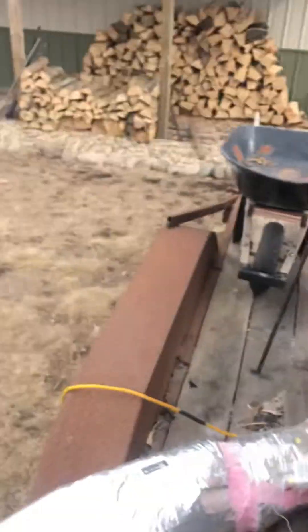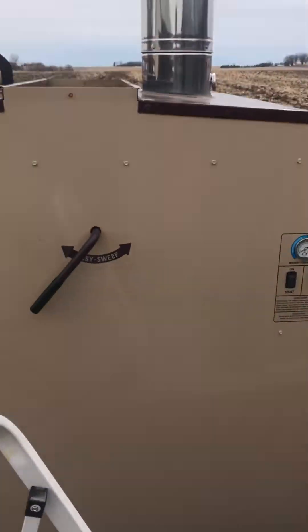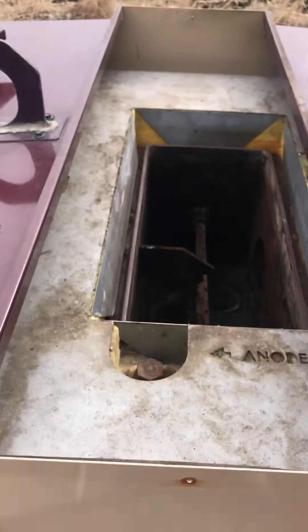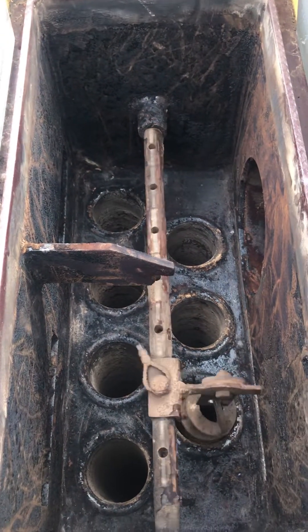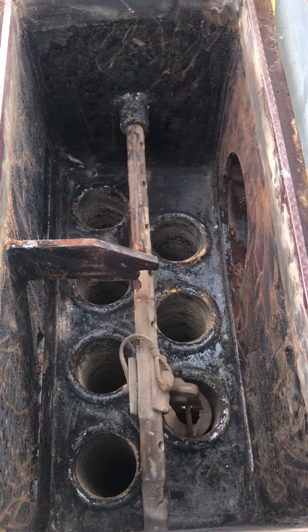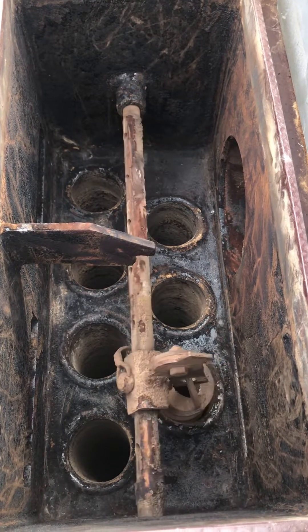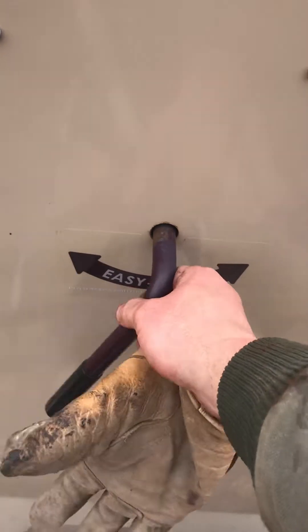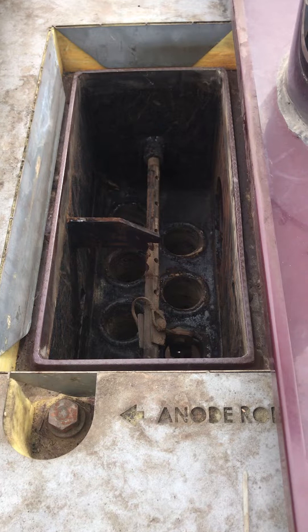Next door we've got the Polar. Polar has the Easy Sweep system — the boiler has circular heat exchangers and in each one is a turbulator. You move a handle on the side of the boiler and it slides those air turbulators up and down, cleaning out the heat exchanger. That's all it takes. You can do it every day, twice a day, as many times as you want. The handle is balanced and very easy to move back and forth.